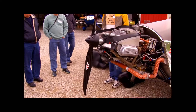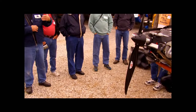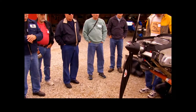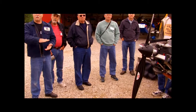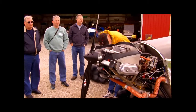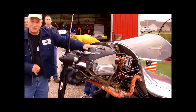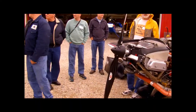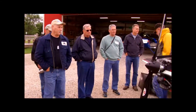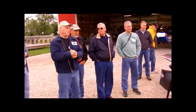The oil temp is not an issue. Originally I had the lower cooler like everybody does when they first build them. I went to the top one and I've never had a problem. I wish I could go to the top one but my cowling is too low — I measured it and it's really tight. I'm going to try to get the top one on mine too, because it's a whole lot easier to get down to the bottom if you don't have the oil cooler there. It's one of the few mods they've allowed us to do that actually works pretty good.